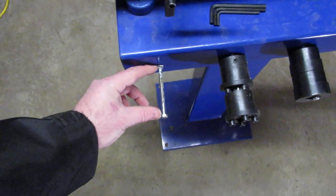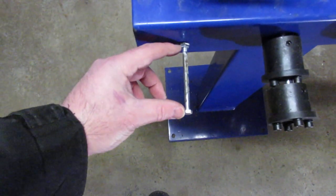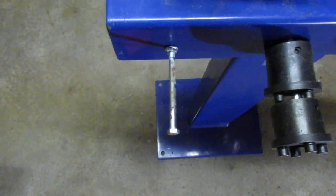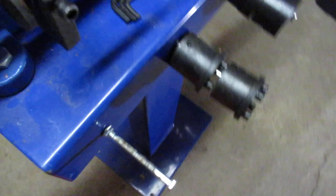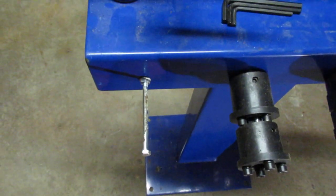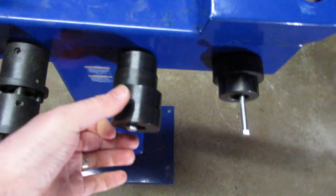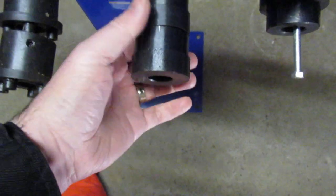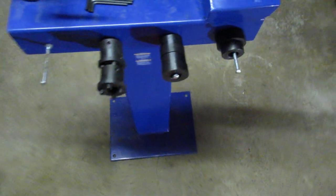When I put these die holders on the first time, I bottomed out the threaded section, and then all my dies were falling off — that's why one of them rolled away. What you really want to do is not have any threads protruding on the inside. It's a bit counter-intuitive, but this isn't holding any life-safety equipment together, so it's alright to just barely seat the threads, and you'll see that the dies fit perfectly. Otherwise they hang loose and keep falling off.